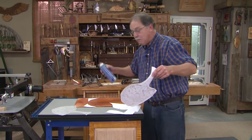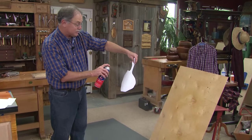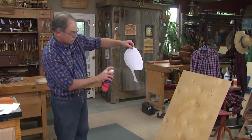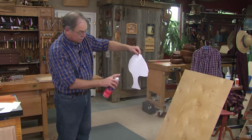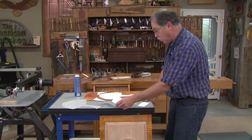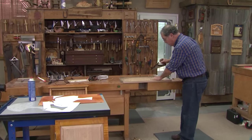Here's the easy way to cut a pattern like that out — make the pattern. I drew a pattern out and copied it at 8.5 by 11 maximum size. It says 'out' which means I want this part of the pattern to pop out, and the other pieces that say 'in' use a different technique. Now, temporary bonding spray adhesive — I have a good backer over there and I want a light, uniform coat. This is key: spray it on and let it cure for two to three minutes.